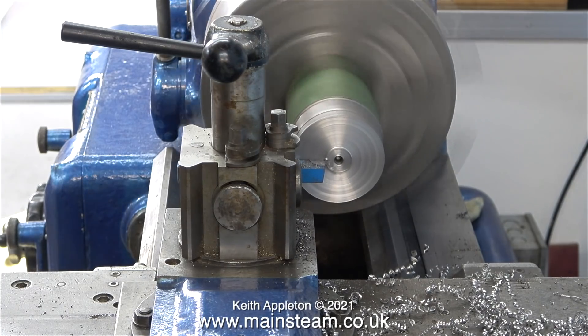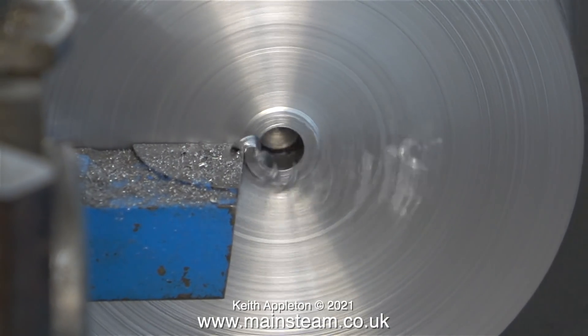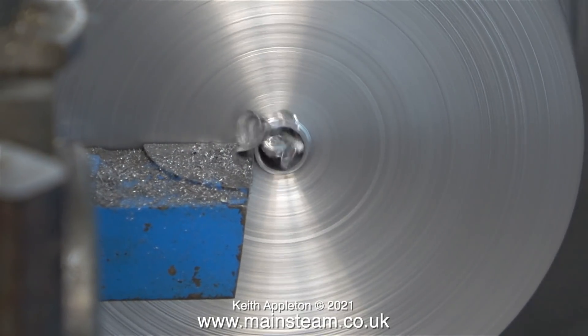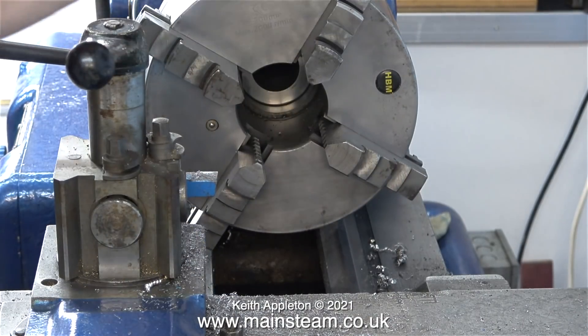In these demonstrations I'm really treating the lathe very carefully because I've broken a couple of tool holders — when they sit right at the bottom of the tool post they really aren't supported very well. I continued to take gentle facing cuts and eventually I got through the hole that's in the center of the piece of steel.